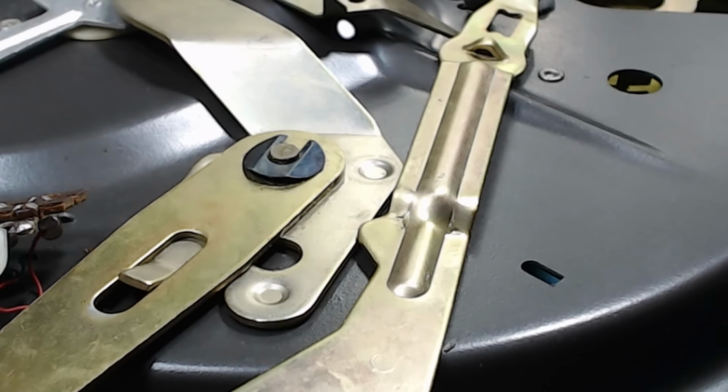Yeah, good. This is the tone arm mechanism. There's a pivot there, which I've already cleaned. I'll just put a drop of oil on that. This is the record sizing pull. Put a bit on that as well. And they all go in there. That's all part of the same mechanism there. There's another part of it underneath here. I don't want to pull all this apart to try and get some grease in there. It's very free. There's another bit of it there. It's just rubbing on the deck. I'll just put a bit of grease there for no real reason.